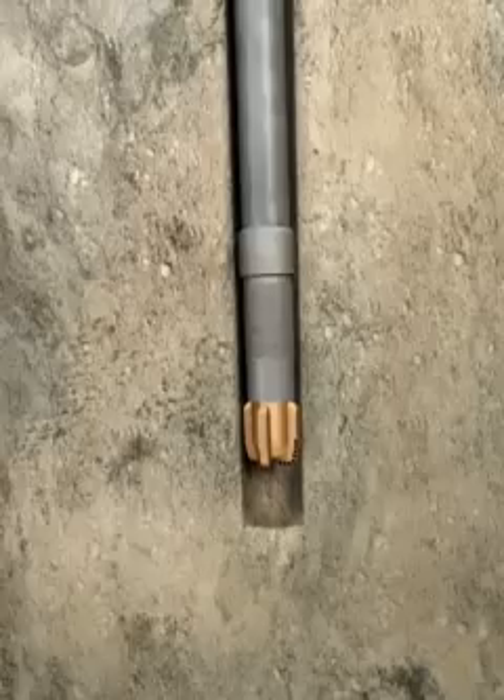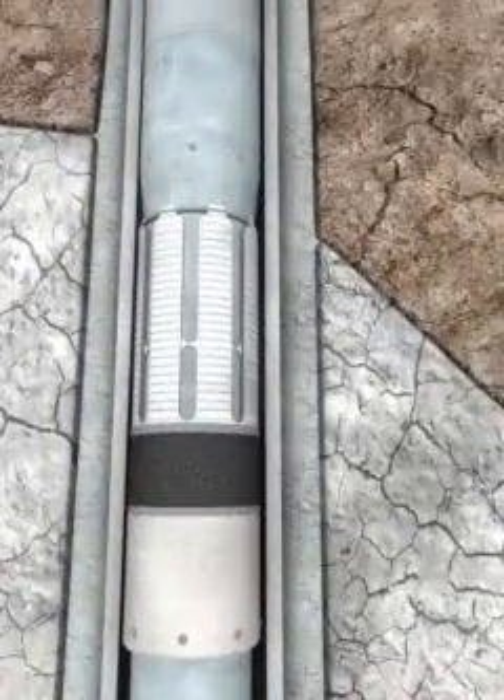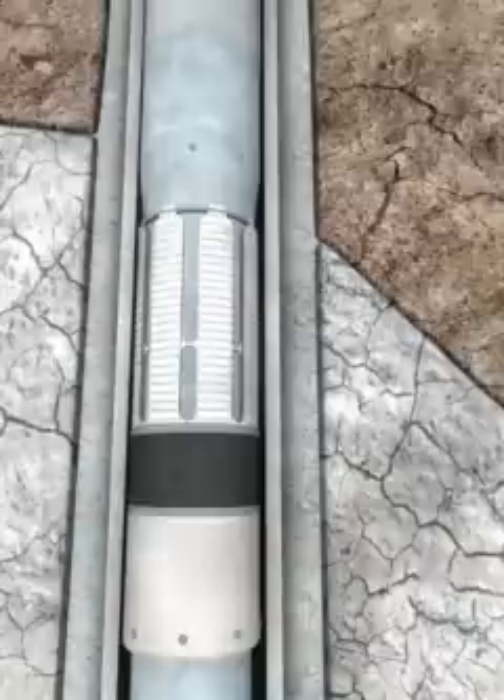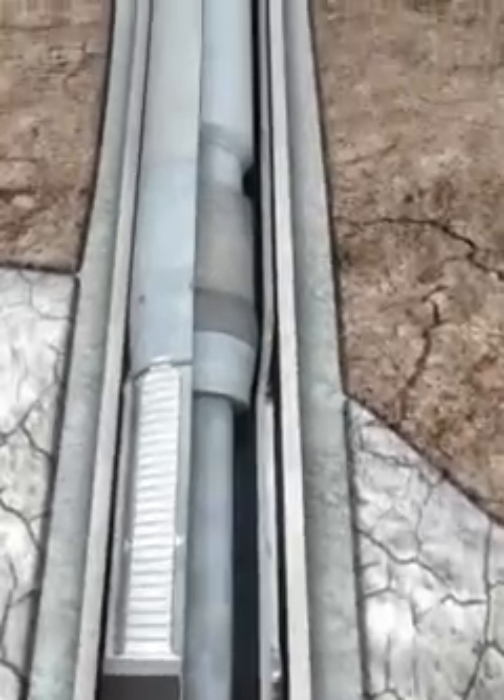Multiple hydraulic cylinders are compounded together, providing sufficient downhole setting force to the swedge assembly that expands the hanger slips and annular seal. The expansion of the hanger packer is a two-stage process, providing for the individual actuation of the hanger and then, following cement displacement, the energizing of the packer, all in one trip.